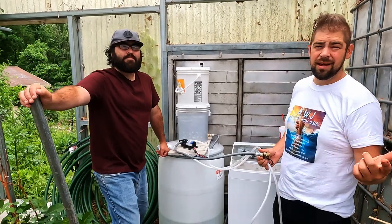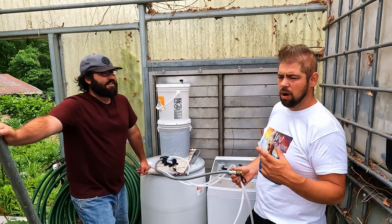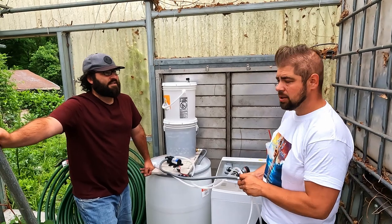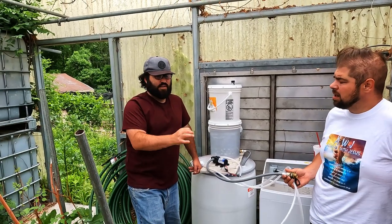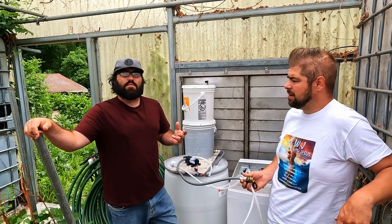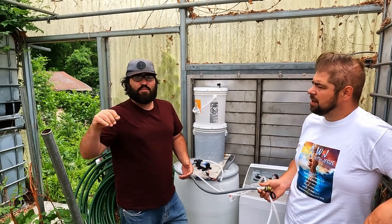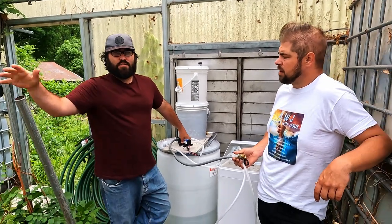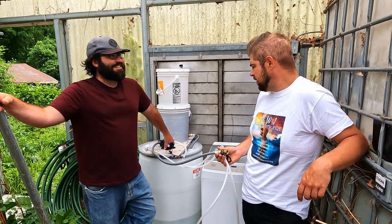In the middle of the woods, campsites — and then 40-plus PSI. If you have water-efficient fixtures in your house, you can get some pressure through your house. A standard sink faucet with an aerator is normally 1.5 gallons per minute; a standard sink without is 2 to 2.5 gallons per minute. So it'd just be a little bit slower than a normal one, running on just this tiny little pump. It'll run a normal spigot or shower head — a high-efficiency one. We're going to put this thing through its paces and see if it keeps up.